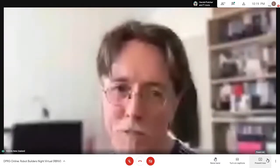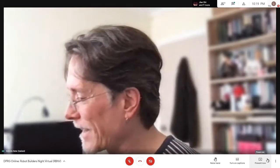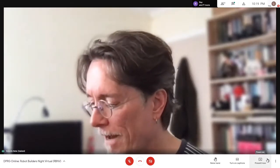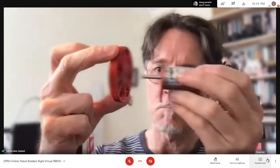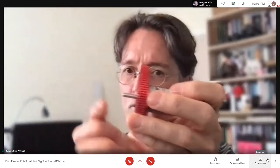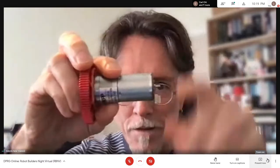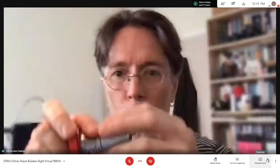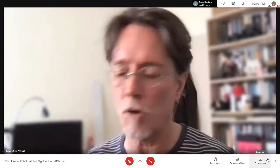Well, it kind of reminds me, I'm starting to look into building a rocker bogie robot. And of all of the rocker bogie robots I've seen, the vast majority of them, and I'm going to try to demonstrate this, have a wheel and a motor. And the wheel is over here, and the motor is over here. And if you look at these things online, you figure that was actually driving across a landscape, that motor is going to be banging into things. They've never actually enclosed the motor inside the wheel. In fact, I can't even find wheels deep enough to put my motors in.